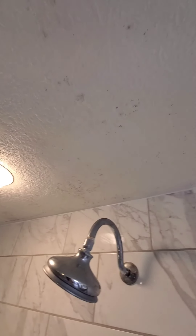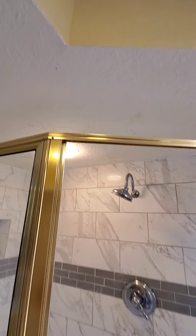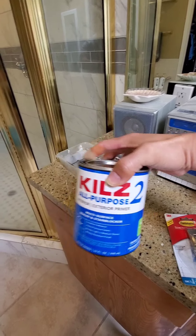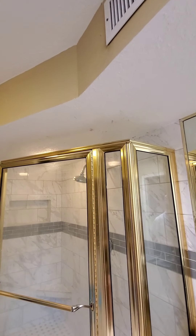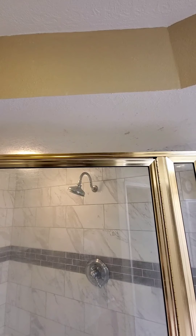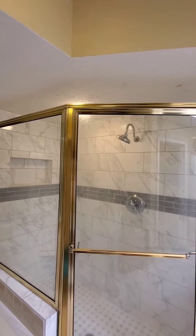What I'm going to do is — I didn't really scrape, I just washed it down a little bit with some bleach water earlier. We're going to be using Kilz All-Purpose Number Two and a little roller just to roll it on. That will take care of the mold problem — it prevents and seals the old mold that's probably underneath, and it prevents it from coming back.